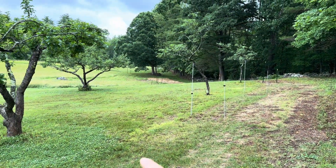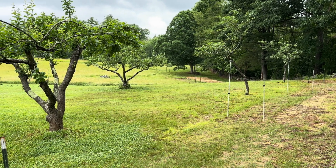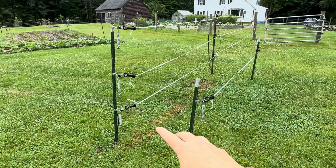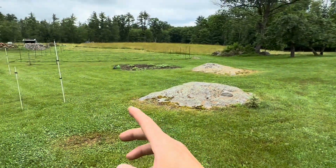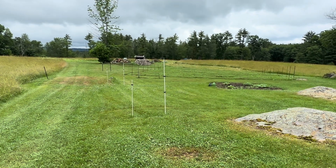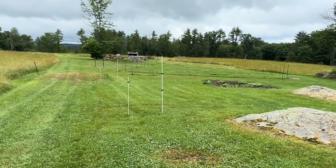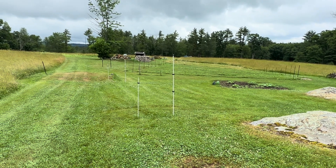I drove in the posts down in the corner — you can see way down there — and the other corner to bring it up the other side. On this other side we're coming off our existing fence. Here's another gate; I dug a trench there and buried the wire in garden hose and made the connections. Those T-posts mark a change in direction, and out there where the tractor is is where the next corner is, then it shoots straight across. Now it's time to run the tape around and get all these fiberglass posts in.